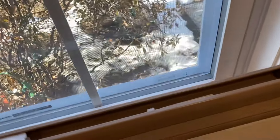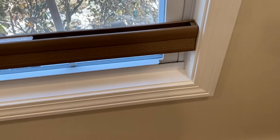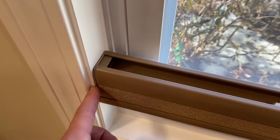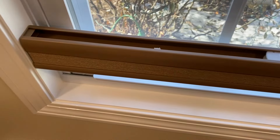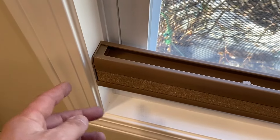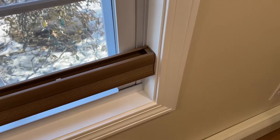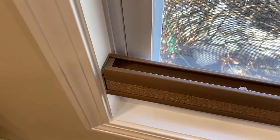The reason I'm trimming is because when I put these in here they are super tight. These are blackout shades and I want it to be nice and dark when I pull them all the way down, but this is going to end up rubbing on this trim and expansion and contraction may make it hard to use. I would say a good length would be a half inch smaller than the opening, which gives you a quarter of an inch on each side.